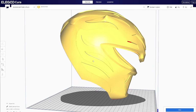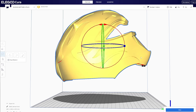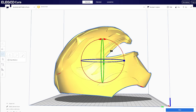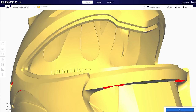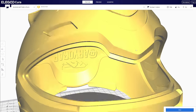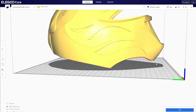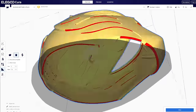Here's the helmet sitting in Cura and we're gonna tilt it back. This is gonna be a little bit of a tricky print. You could print it upside down but I don't recommend that because of all the detail. I'm gonna try to flatten it down and tilt it forward a little bit more. My biggest concern is this little widow's peak eyebrow thing — because this is going to be printing in mid-air, I need to make sure this part is supported. A printer can't just print in mid-air. You could have some pretty crazy overhangs, but you want to make sure that this is supported.